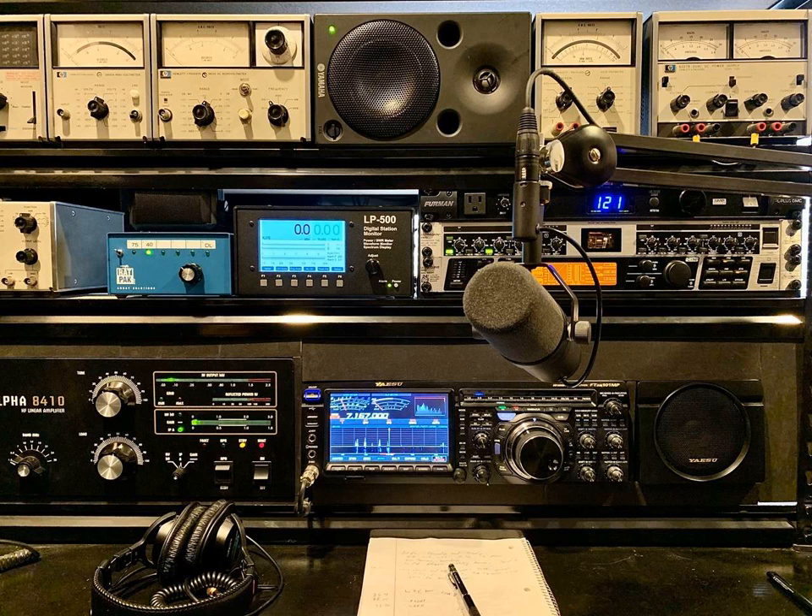Here are some other settings for my own notes. AMC control at 80, and mic gain right now is at 25. I set the AMC control to fast under the advice of somebody just to try it and see how it sounds, and I do seem to like it. Mid-range ALC, not seeing much activity on compression — every once in a while I'll see it pop up to maybe 2 to 5 dB.